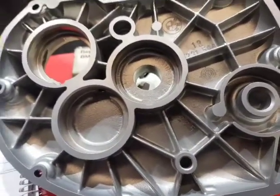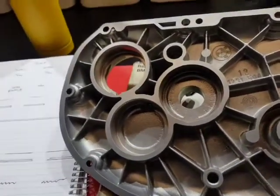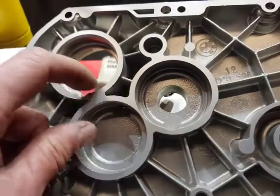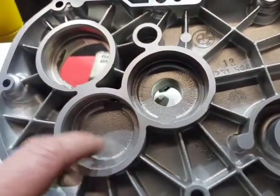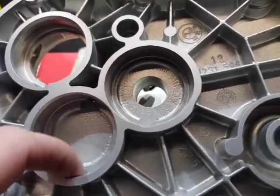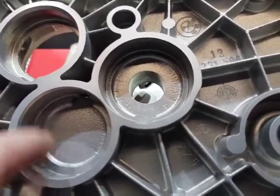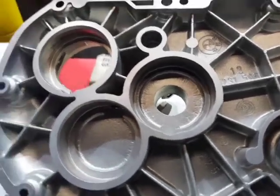So this is the back of the backing plate. And then what you do, once you've measured that distance I showed you just a minute ago, you measure the depth down here to where the bearings sit in the backing plate. Now bear in mind in this one here, this is a blind hole and the hole at the opposite end in this case is blind also. There is a shim that will go in there to create the correct end float between that machining at the end and the face of the bearing — it has to have a certain amount of clearance.